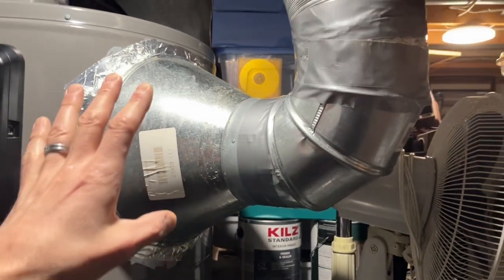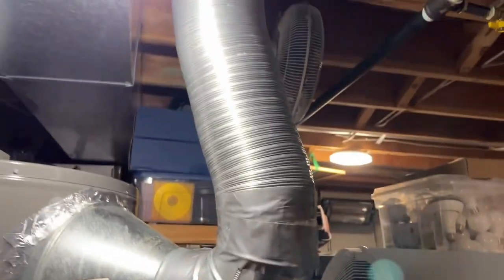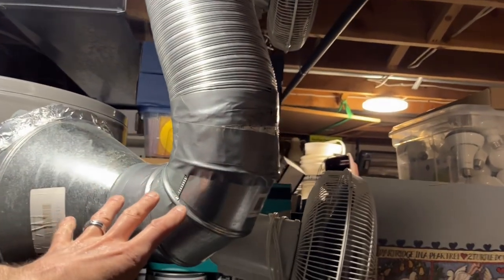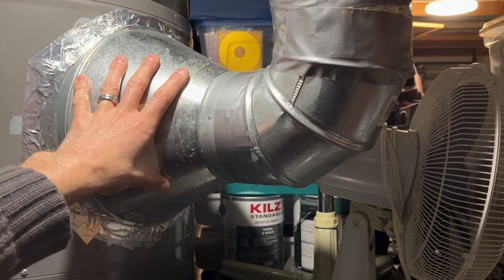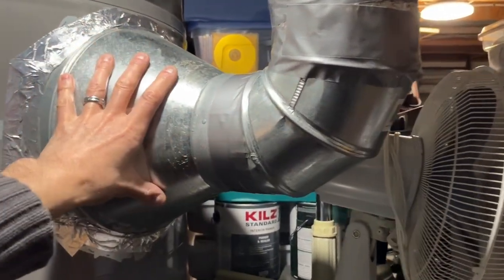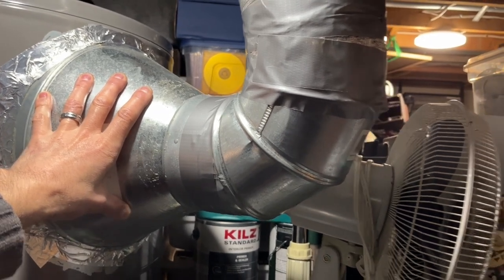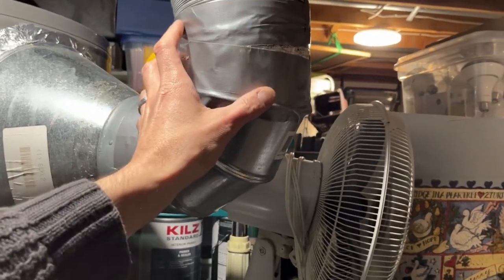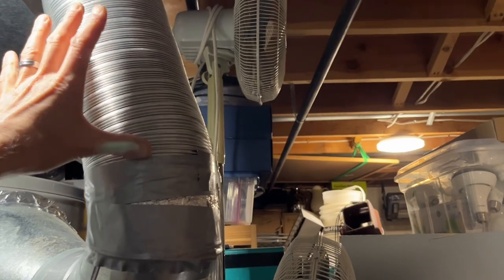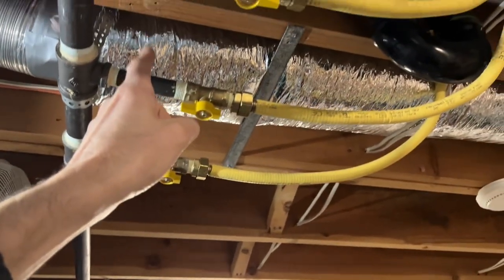In the manual it goes through the amount of restriction — if you're going to put any ducting on, please really take your time studying how much each bend adds. I'm actually past a 90 degree angle here. A reducer is worth about 20 linear feet, a 90-degree bend is worth 10 linear feet, and flex duct has a 3-to-1 ratio — so a 2-foot rise in flex is worth 6 feet, plus 10 feet for a 90, and then we finally get to my rigid piping.